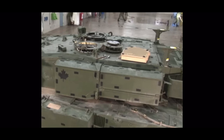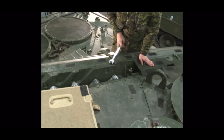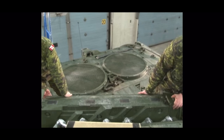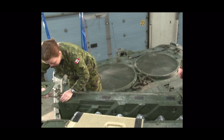Opening and closing the MBGD armor is done to maintain the MBGDs. The weight of the armor requires that two people must open and close it to maintain control. Opening the armor is done using a 24 mm wrench. First, remove the two retaining bolts. With two people, rotate the armor outward, maintaining control. Putting back the armor is done in reverse order. Using two people, rotate the armor into its original position and tighten the retaining bolts. It is important to note that loading and unloading can be performed as per the A6 or C2 method with the armor in the closed position.